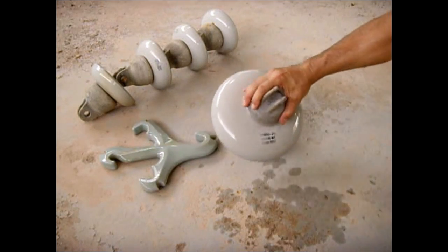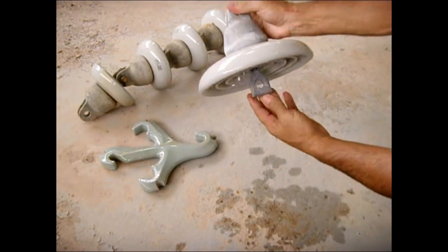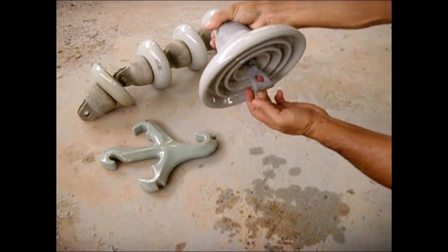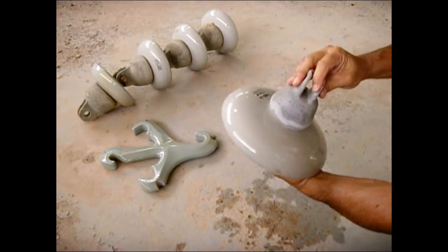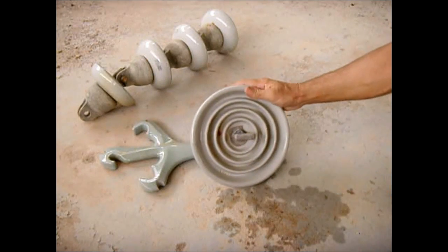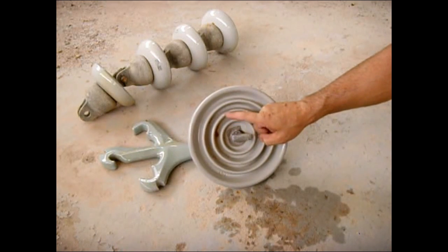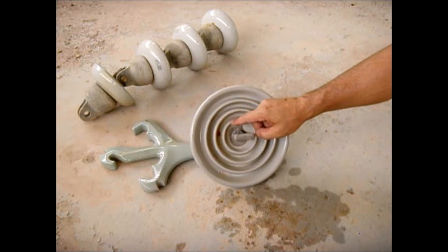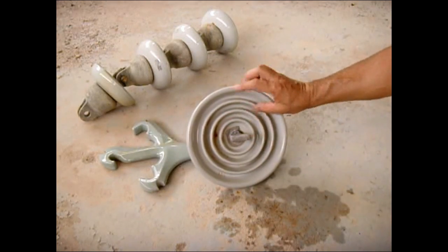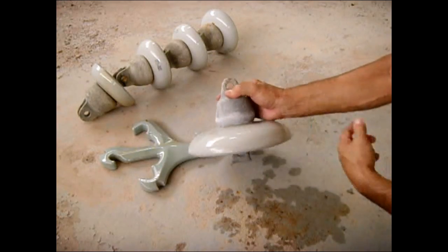This one here is a much larger one. This would connect up to a pole on this end, and you could have your high voltage wire connected on the other end. This one is rated at 15,000 volts, and you can see there are a lot more ribs. The voltage would have to jump from rib to rib — salt would make it much easier to get across, but if it's only rainwater you may only see a little bit of corona after a rainstorm. Once it gets past all the ribs it would then have to flow all the way to the mounting point to make it out.